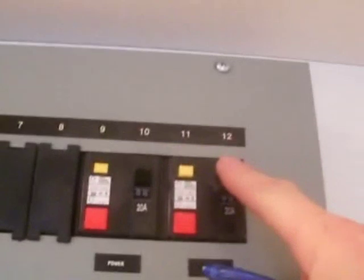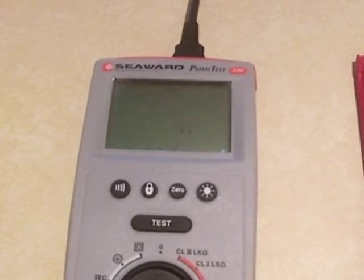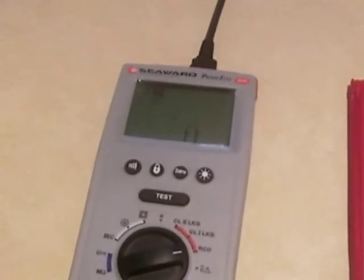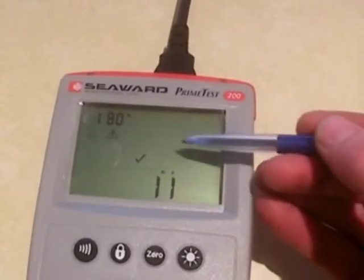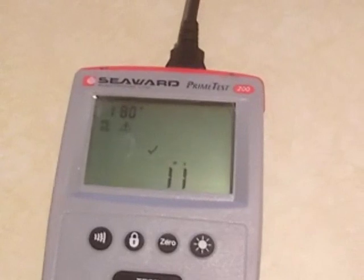21. So I'll reset it again. Come back to the tester one more time. You're left with 7, or 11. So there you go — that's correct. It's ticked and it definitely passed. And that's how you test an RCD. If it actually goes above the 300 milliseconds, that tick there will actually turn to an X, saying that it failed. I haven't come across a fail so far. But it will say tick if it passes. It's pretty straightforward — log all your stuff afterwards.